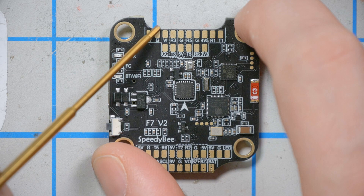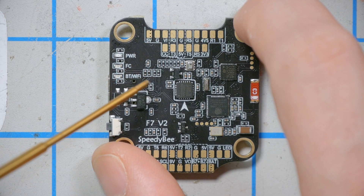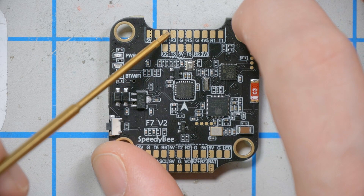This section is for the camera. We've got 5V and ground, VI (video in) for the signal coming from the camera, and CC for camera control. Camera control is a Betaflight feature that lets you adjust camera settings from your controller as if you'd plugged a joystick directly into the camera. It doesn't work reliably with all cameras, but I'll link a video about it in the description. There's also a UART here — T3 and R3 — which you could use for digital camera control or anything else you need a spare UART for.